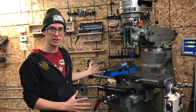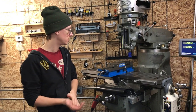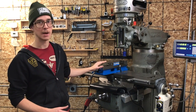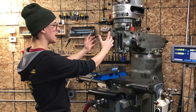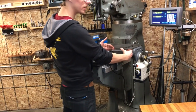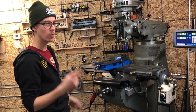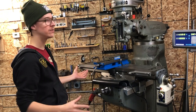It's not the most rigid milling machine, it's not the most horsepower, it can't do everything under the sun, and it's not the most feature-rich. But it's got it where it counts for general-purpose machining. That's why you go into almost any machine shop, a lot of automotive shops, a lot of welding shops, and you'll see this machine. You can move the ram in and out, tilt the head, raise and lower the table. If you need to, you can bolt a long piece of work to the front of the table and machine the end of it. It's really versatile, and if you're a frame builder with a small shop who wants one milling machine, this is totally worth it for the wide variety of things you can do.